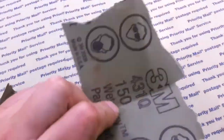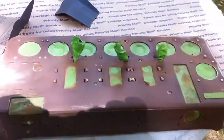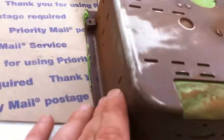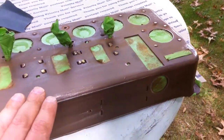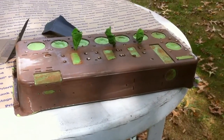I've already sanded it with some 150 grit. I didn't have any 200s, so the next step is 320. It's looking pretty good — a little rough. Here was the worst area. This is just where the lacquer thinner I used to clean everything up took the paint right off. Other areas it didn't do that, but it took it right off because I was using it to clean the layers of dirt off.